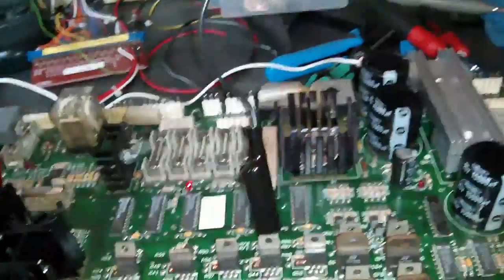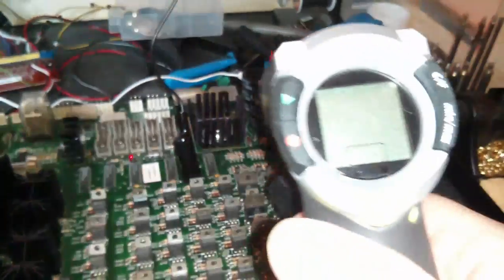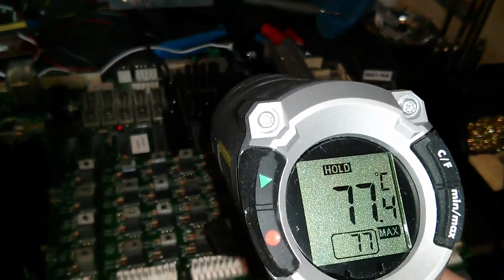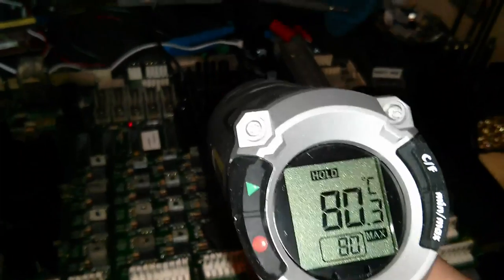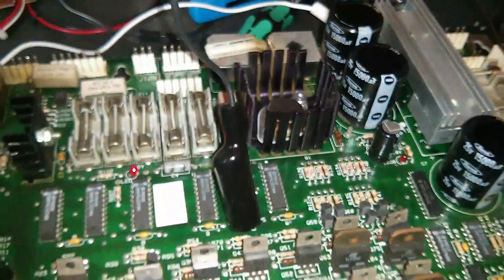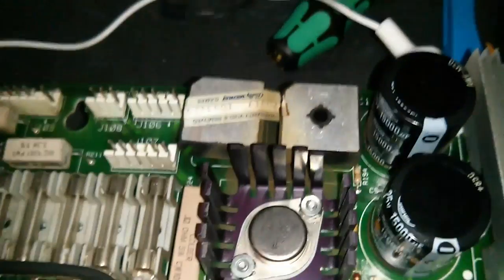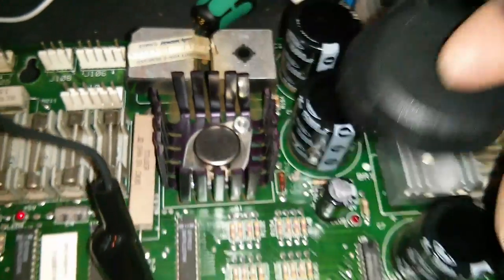Efficiency's not terrible then, is it? These things get hot. I'm going to grab my thermal meter. It might have been on for about a minute while I ran off to get my temperature monitor. 77... 80 degrees. Let's not run that for any longer. It might well be designed for 3 amps, but with that heatsink it can't do it. So it's up to about 80 degrees - that's pretty hot. Look at the label there - it's cooked from its previous life in the machine, heat travelling up and baking the dust on there.